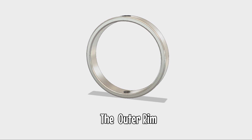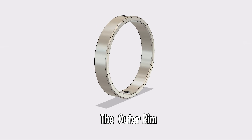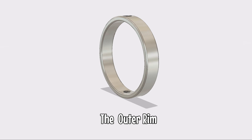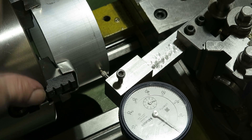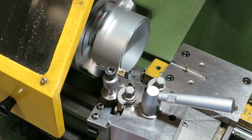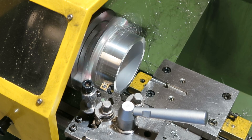So now it's on to machining the outer rim of the gyro. This is just cut from some aluminium pipe, and it's just a copy of what Chris did. I'm using my DTI just to get the pipe central, although to be honest it was a bit egg-shaped, so it's probably about the best I could do.